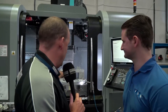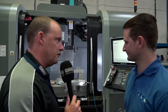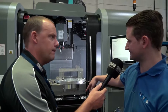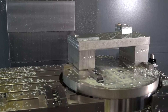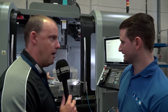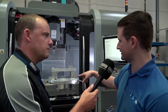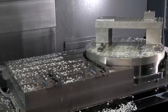That C-axis, Andrew — is that sitting flush with the top of the fixed table if you take your fixture plate off? No, the C-axis is about half a millimetre lower than the rest of the table. And would you take that off and use the benefit of the whole table — put a plate on there for example? Yeah, you could take it off and do whatever size of the envelope of the whole table if you wanted to.